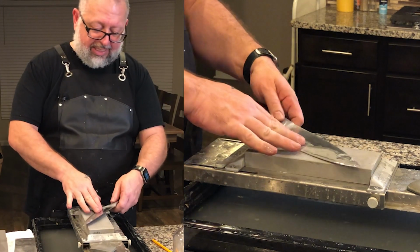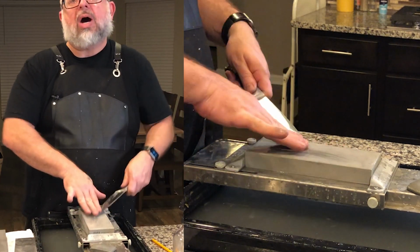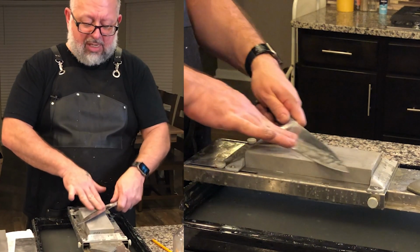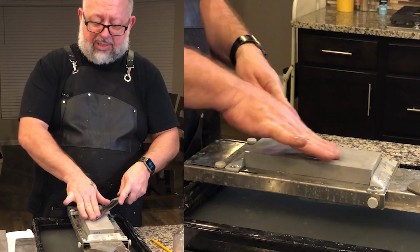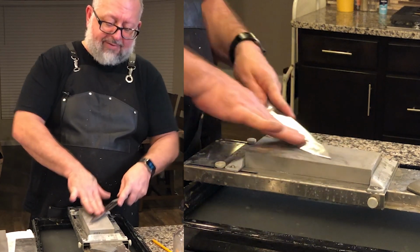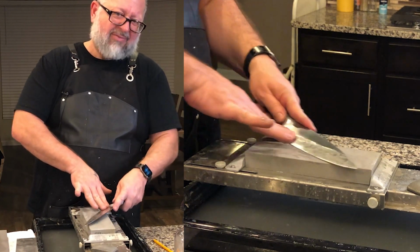Okay, so we're getting each side. We're getting that wire edge lined up really good. Now, you're probably asking me, why are we going to the kangaroo strop and why are we using a hanging strop? If you have not watched the stropping series, then you wouldn't know. So we'll elaborate, and I'll definitely put a link above to the stropping series. Whenever you're going to strop a knife that is softer metal, of like a Rockwell hardness of 60 or below, really like a 59 or below,